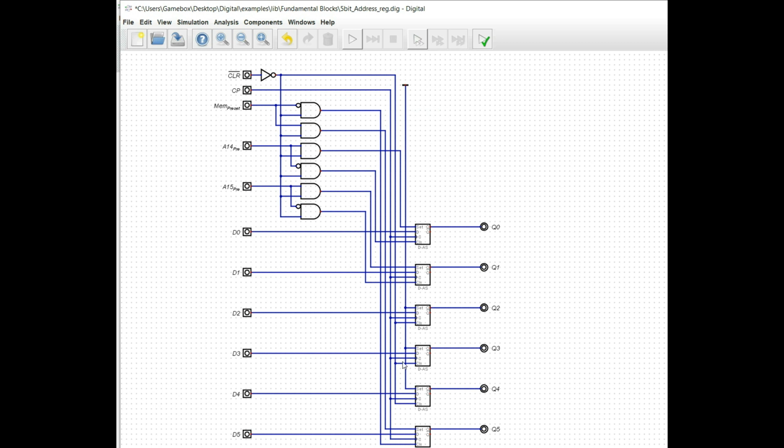Now, we know that we need to be able to reset this to a known value when the system is reset, and if you didn't think about this ahead of time, each page would end up being set to the same area of memory. This is pretty easy to overcome in software. The first thing that you do whenever you boot is to reset the page locations and then jump to the next area of code. But we want a memory mapper that is more universal. That way these things are going to start up in known states.